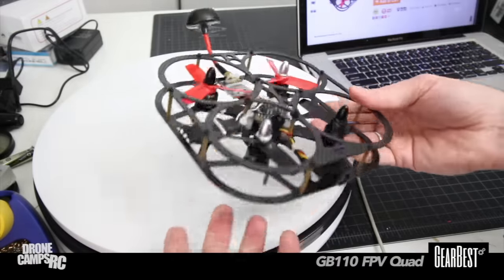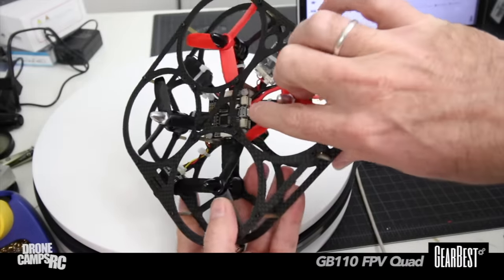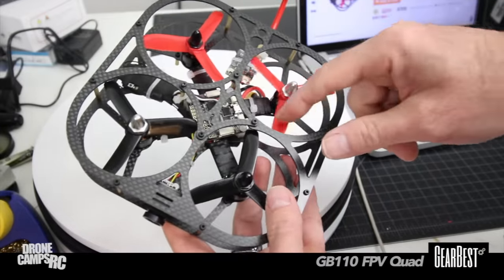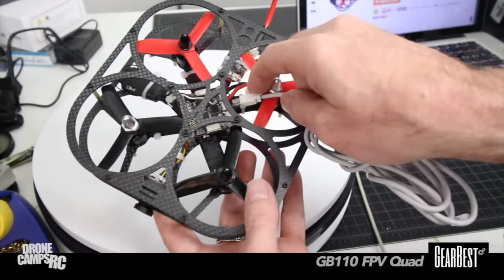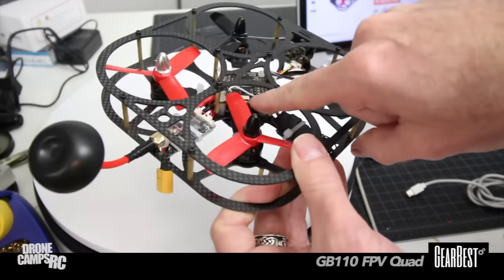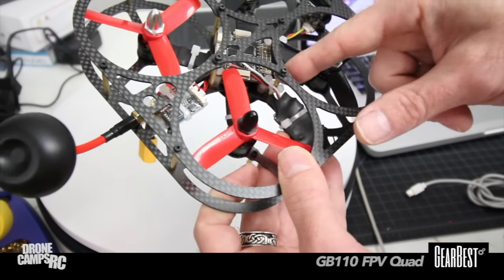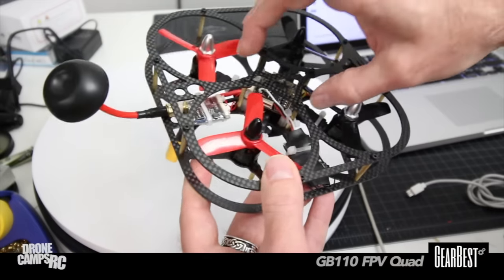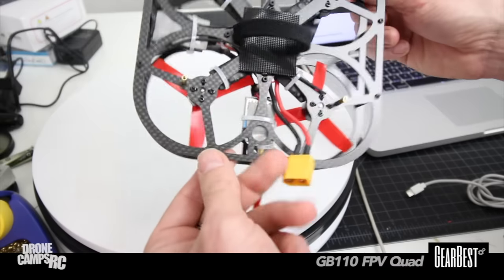I have my Taranis hooked up and it was pretty easy to set up in Cleanflight, but it's kind of hard to get the USB cable into the slot because normally we don't have a cage around the quadcopter. I thought I might have to take the prop off to get to the USB port, but I was wrong — you can still get it in there, it's just a little tight. When putting your receiver wires up inside, make sure they're as short as possible and put a zip tie around the post as they pass by over the flight controller. I didn't want to run it underneath because all the wires down there are pretty tight anyway — it's a super compact wire-soldering situation inside this quad.